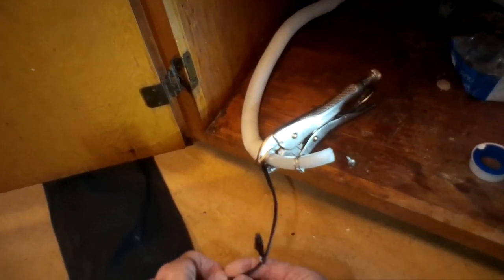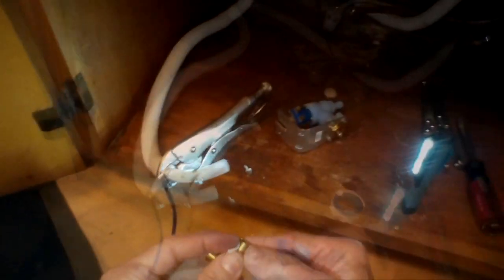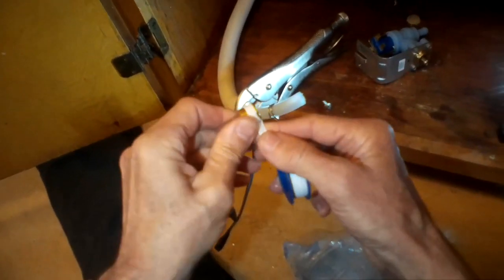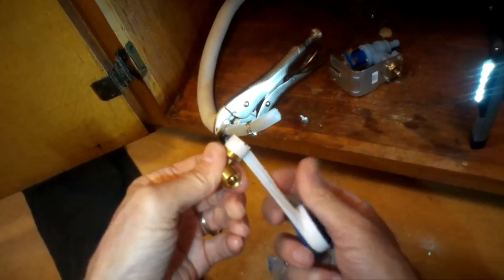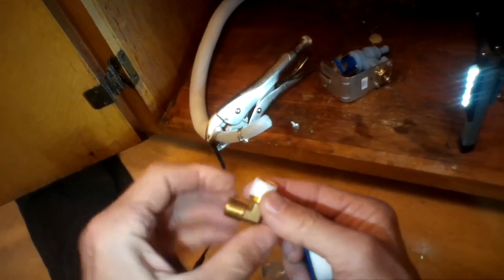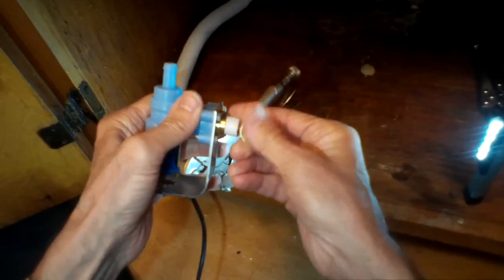Now we've got the tube shorter, the wires long enough and stripped back, the new spade connectors on, and everything wrapped in electrical tape — so the power supply is ready. We're going to put the brass elbow onto the fill valve and wrap it with Teflon tape to make sure there's no leak. This is Teflon tape designed for water applications — just get it at the hardware store. Wrap it around and then thread the brass elbow into the fill valve. Once finger tight, use a wrench to get it even tighter — you just don't want anything to leak.